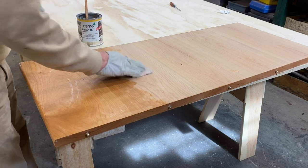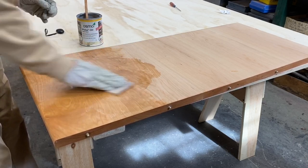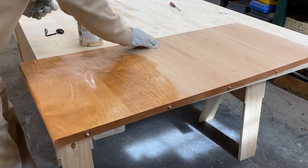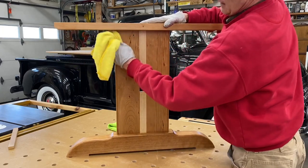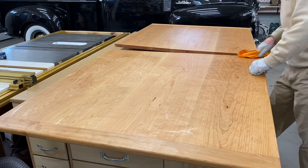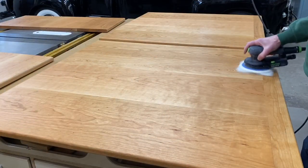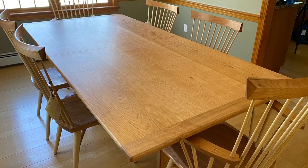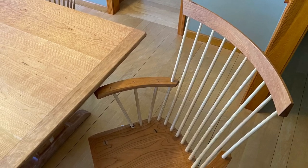That pinkish tone in cherry will darken up over time, so I chose not to stain it — I'll just let it darken with the ultraviolet rays of the sun. Once you get the Osmo rubbed on, you try to put it on as sparingly as you can. I took a microfiber towel — the instructions call for wiping all the excess off. It's a little sticky and takes some effort, but once you start to rub it you get a nice satin finish. I used the same applicator pad on my sander to buff everything off, and I'm happy with the way the table came out — I think it matches the chairs nicely and I'm looking forward to using it.